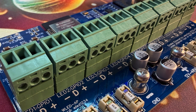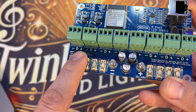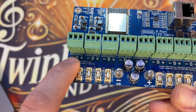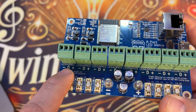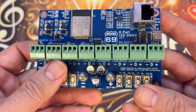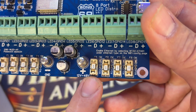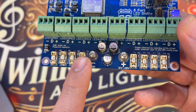It's got eight output ports, each labeled with data and power terminals D1 through D8. It's hard to mess this up — it's written right on the board. Those are phoenix connectors, and it's labeled clearly on the board how your phoenix connector should be wired. You can see LED1/GPIO1, then your negative, data, positive — LED2/GPIO2 — and so on, all the way down.